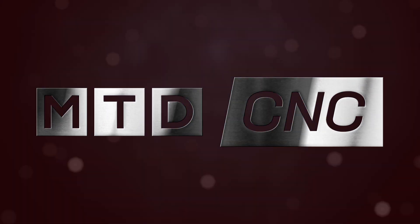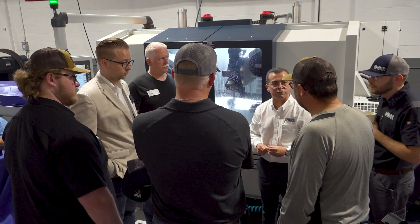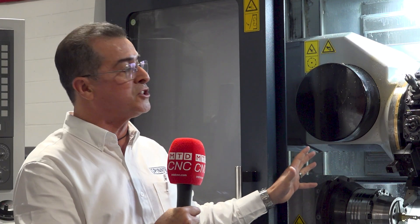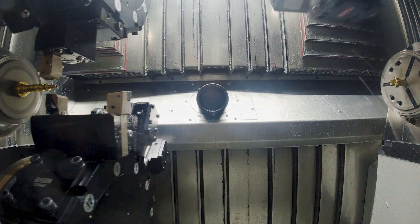So when I think three turrets, two spindles — what do I get to do with that? You get to do a lot, and you get to do it fast. That's the thing about two spindles and three turrets. For me, it's my bread and butter because I make it dance. I come up with ideas that are out of the blue. This machine allows me to work on one spindle with the three turrets or on the other spindle with the three turrets. The specifics of this one: you can run with all three turrets, you can do pinch turning, and you can be drilling at the same time with the upper right turret. So the possibilities are endless with this machine.